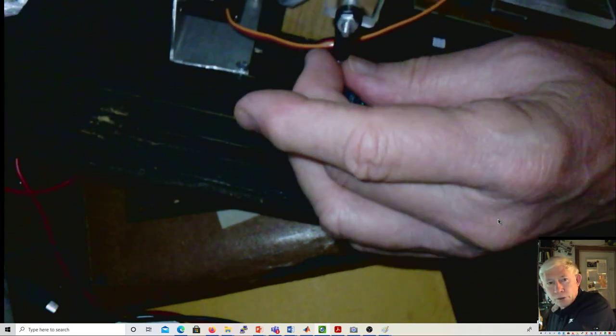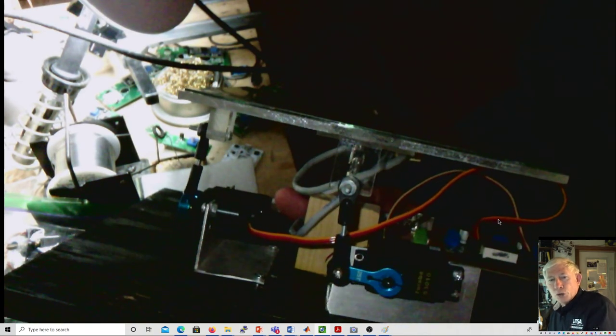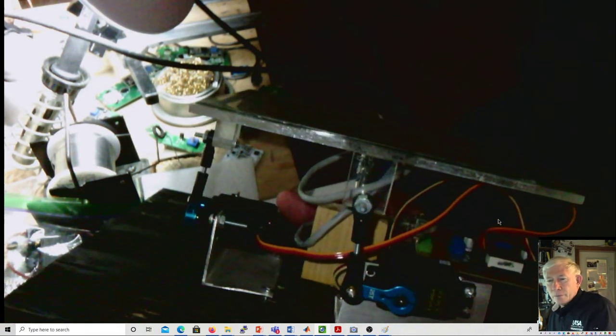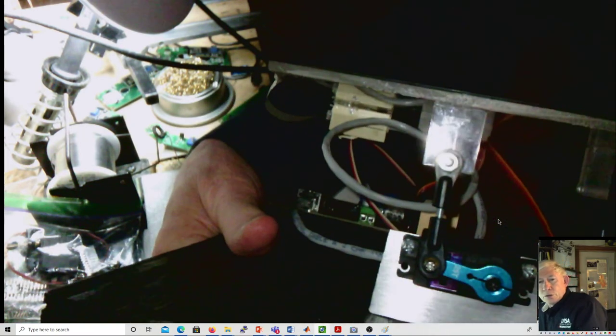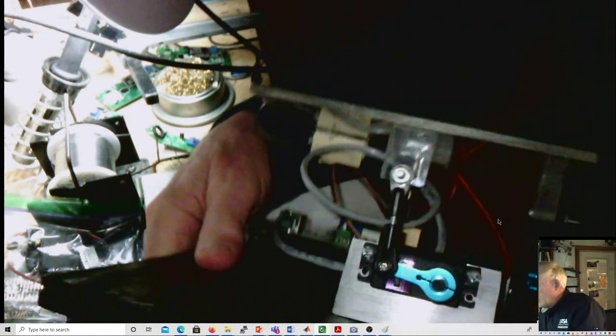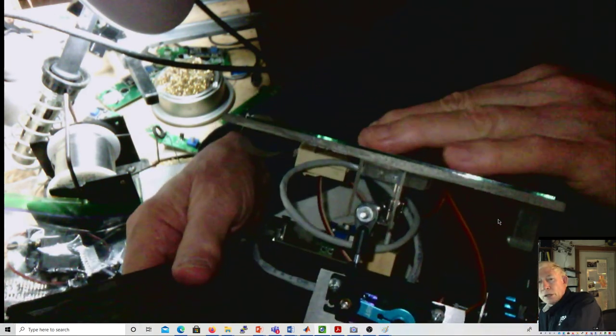And then we have a little push rod here, which is adjustable. It's a little screw, and you can turn those end pieces. When you turn the end pieces, you can make the rod longer or shorter. Now, some of them are maxed out. There's one on each side, and the one over here, too. What we want to do is, in the neutral position, when the shaft is horizontal, we want the tilt table to be level, as best we can with the base, anyway.